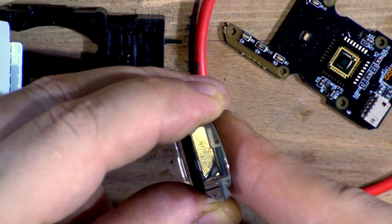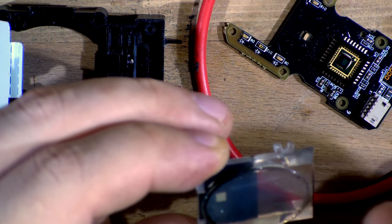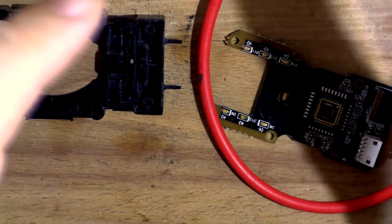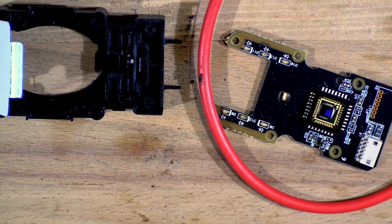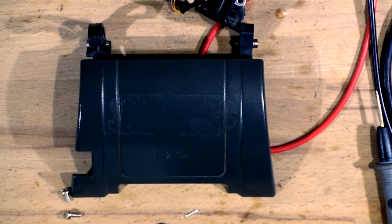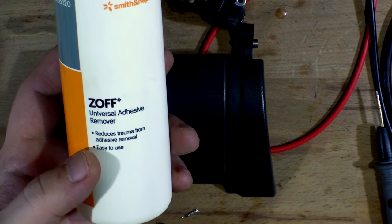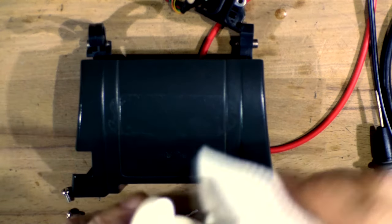You can see the fingerprint image very clearly as I push my finger on it. The surface is plastic with a rubbery silicone gel over the top which I'll have to clean before reassembly. That's how the fingerprint scanner works. I'll clean everything up, reassemble the side panel with the scanner and card reader, then open the receipt printer and refurb it, before resoldering the capacitors.